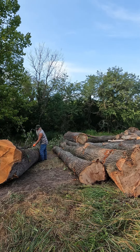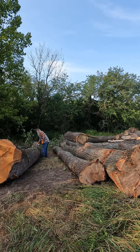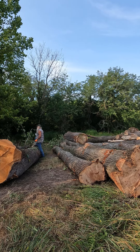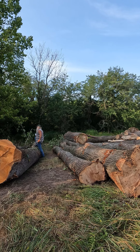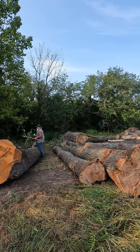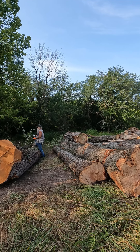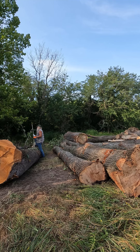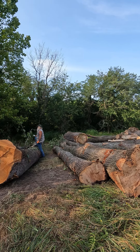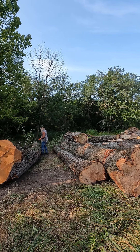This here is how to do it. You're doing a good job, Matt. I guess they could bring over that 880. We've got to get that black bar — I think we'll have to cut that. I think that black bar at home, that four-foot bar, I think it's 63 inches. We'll have to go to Johnson Reynolds — that'll fit it. I wonder if we've got to change the sprocket too. That 3-8 sprocket will run that, but if it's 404 it won't. I'd get a 404 sprocket. I don't remember what it was, but that obviously screwed me around when I told him to order it. I didn't think nothing about it and he ordered it — I'm pretty sure it's bigger. There's still paint on it, surely. We'll see you tomorrow.